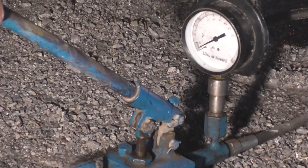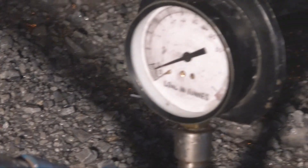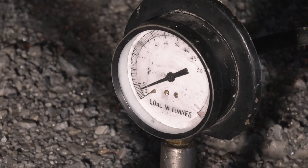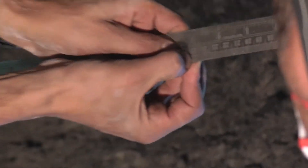Initially, a load of 500 kg is applied to take up slack in the equipment. The tensile load is then applied to the rock bolt in incremental units at a loading rate of 250 kg per minute. The load is applied up to the limit of 80% of the yield load of the rock bolt through the hydraulic jack connected with the hydraulic pump.